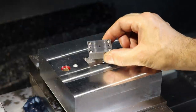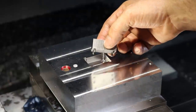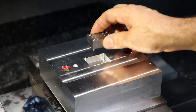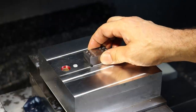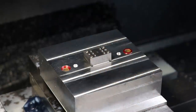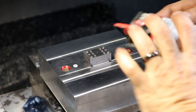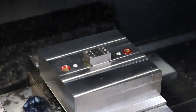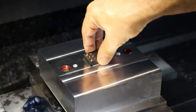Okay, so this is the A-side mold insert, and we've got these M3 screws here, maybe too much stick out on the bottom. Can you see that? Yeah. So what we're going to do now is basically insert this guy into our mold body. Make sure it's nice and clean in there. And this can be a little tricky at times. Actually, sometimes it's good to stick some oil on it. Because with a tight fit, any kind of angular misalignment can cause these parallel surfaces to jam up with actually a lot of force. So by lubing them up, it helps prevent the locking in of these edges.